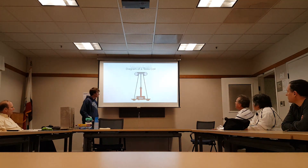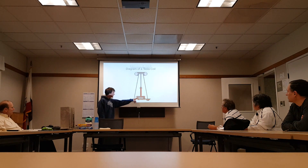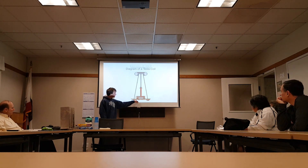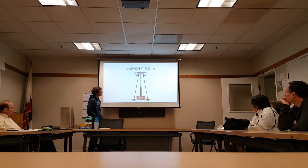This is a figure adapted from one of Tesla's original patents on the magnifying transmitter. Here we have the primary coil in this coppery, orange-ish thing, and the primary capacitor in this diagram. Difficult to see is the secondary, which runs along here. Then we have an additional resonant coil going up here. This is a conductive rod that takes the voltage up to the toroid on the top. The discharge path is from the toroid on the top to the air — to everything.